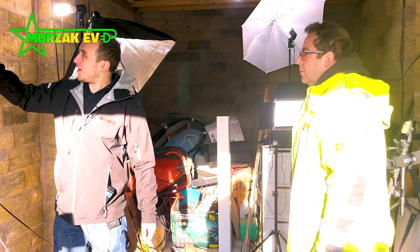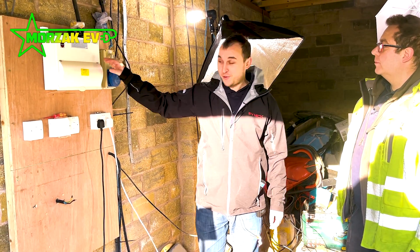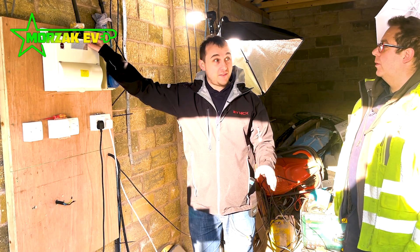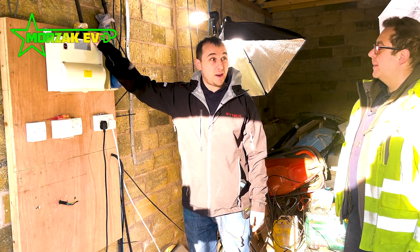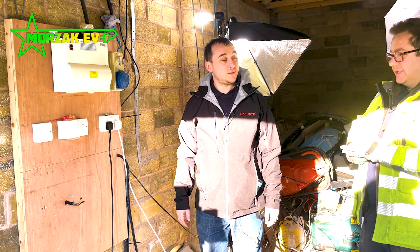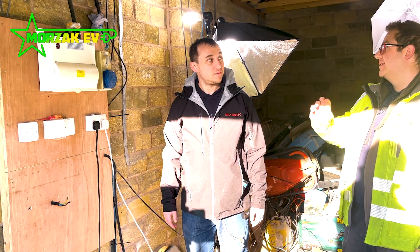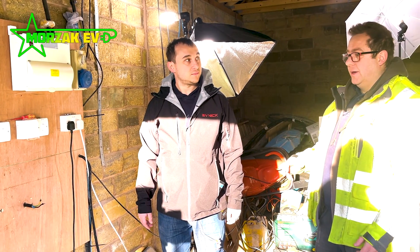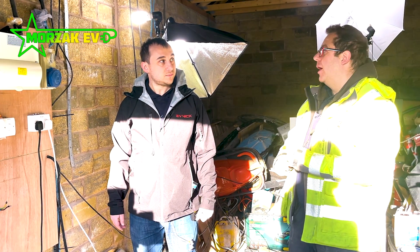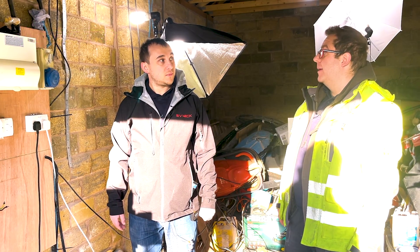For my job, we've had a look at this cupboard over here - this is my garage supply unit coming from my main consumer unit. Now, if someone's already got a garage supply and the installation is going in the garage, is it possible the garage supply might not be adequate when they have a battery? Absolutely. There are a lot of garage supplies on old houses and new builds that are fed from a single socket, and there's no way that would be adequate for installing additional equipment like solar, EV chargers and things like that. So it's really important to assess where that garage supply comes from.